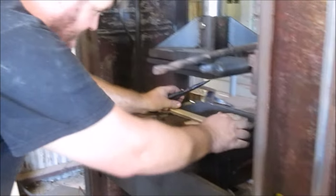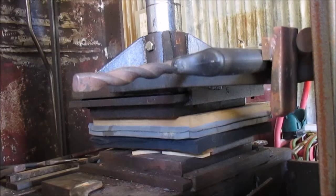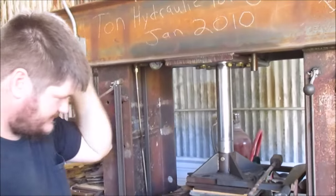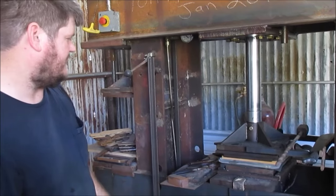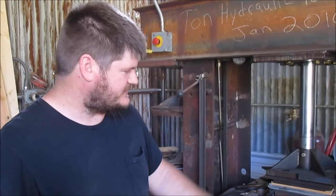That's soft enough. I'll get it in position and now let it sit for about two minutes before I pop it up and take it out. I'll actually go ahead and put the other half of Kydex in partway through and swap around. The surround piece that goes around the outside of the main trim template — the piece that keeps the Kydex from folding over the edges — actually works on both halves; you just flip it over.